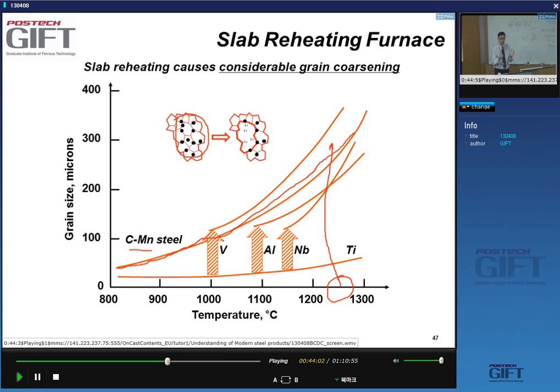Say, for instance, vanadium and niobium, we've talked about these elements because they form small precipitates, small carbides or carbonitrides. We see that when we heat these grades up in a reheating furnace, their grain size remains low for a long time, but then suddenly increases because the vanadium precipitates go into solution. So the grain boundaries are free to move,